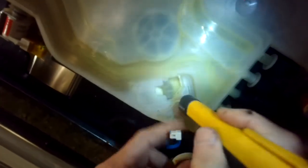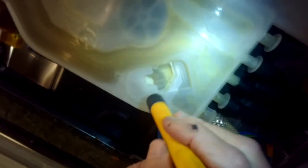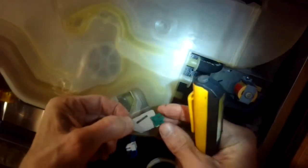There's a pretty powerful magnet at the end of this flashlight, and I'm moving that wheel around because it has a magnet on it — and it's moving very easily. So that's a good sign. I would check that: use a magnet and make sure this little wheel, like a paddle, can move really easily. If it moves easily and there's still a flow sensor problem, these parts are pretty cheap — just replace it.